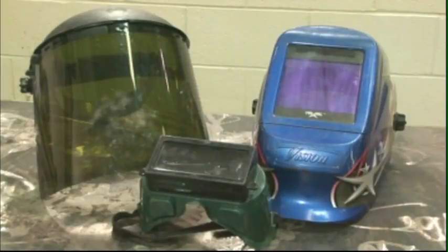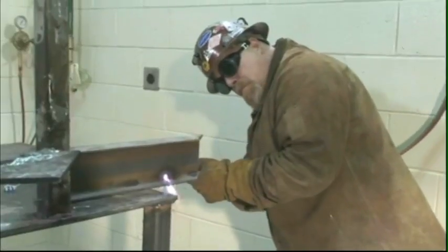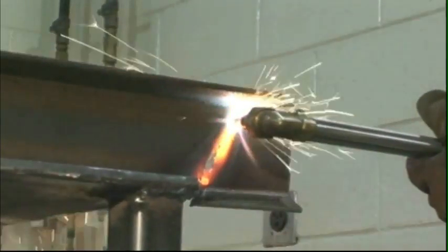It's essential that you wear the proper ANSI-approved eyewear for protection from flying metal and for ultraviolet protection. Goggles with tempered lenses shaded number 4 or darker must be used to protect your eyes from injury and to provide good visibility while you work.